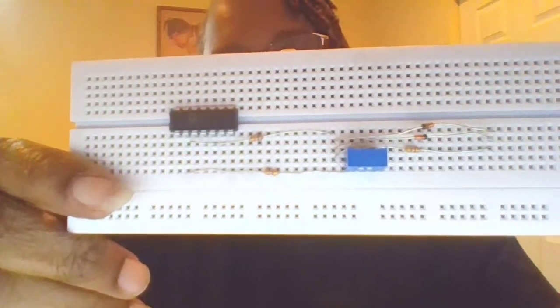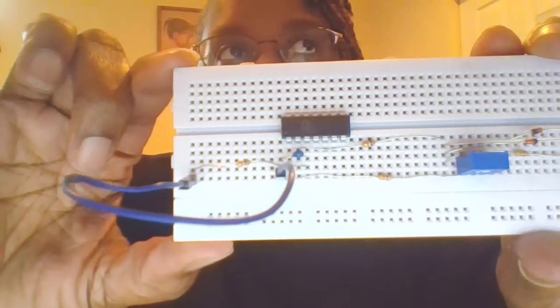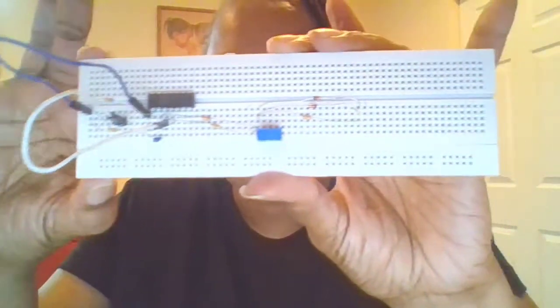Let's work on the positive feedback. I think I now have my low pass filter built — that's R2 in parallel with C2 going to pin three. So here's my 10 nanofarad in parallel with my 10 kiloohm R2 and C2. This is what I get for not planning this out better. If I had planned better I would have put things going to pin two on the left and things going to pin three on the right, but I didn't, so they're crisscrossed. I had to move some things around, but here is my totally completed circuit.